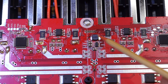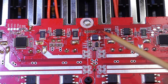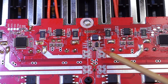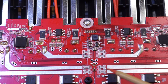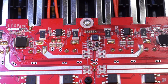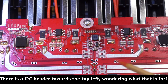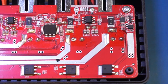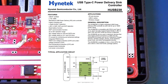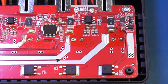Towards the middle, you can see an inductor — a dead giveaway that this is a DC-to-DC converter. I'm not entirely sure what it's doing here, but we also have eight smaller shunt resistors, looking like 50 milliohms each, clearly doing some current measurement — presumably for measuring the charging current, since it can be as high as 3 amps per channel. Towards the far right there is a HUSB238, which is a USB Power Delivery controller, not surprising since the charger supports the USB PD protocol.